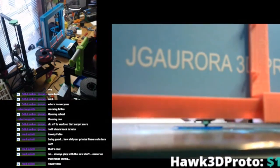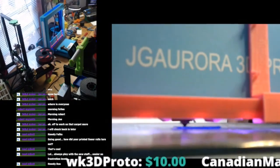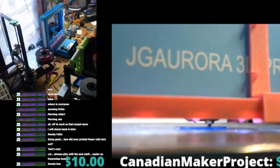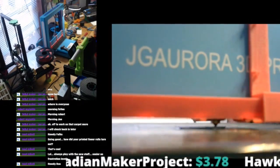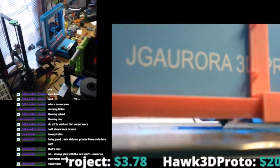I noticed. I'm watching its tool head movement, and it seems to want to lift the head after it prints two layers and starts at the front again. Does it Z-hop? It could be Z-hop is enabled. Like I say, this came from the factory, with factory settings, so I don't know what slicer they use. Yeah, I just did it again. Why does it do that? It must have Z-hop enabled in the print.